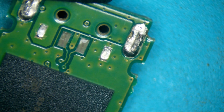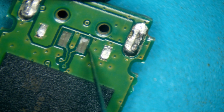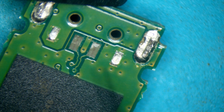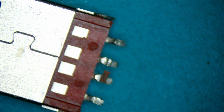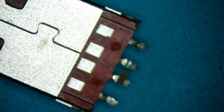We can only assume a few things without a schematic. We see that this trace goes over here, and this one goes over here — so this pad connects to where this trace is going. What we can do is recreate where that pad was going by scraping for some gold. Also, this is a special USB head. When you have USB 3.0, 3.1, Gen 2, and others, they have different types of connections for the head and usually need to be precise because the data lines can be a little different — a standard 4-pin doesn't always necessarily work. So we're going to reuse this head because it's not bent.